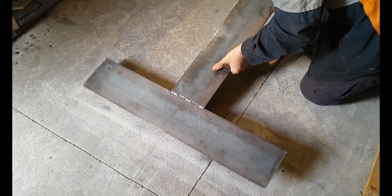You'll have a bottom plate that doesn't wobble. You need to measure the halfway point first. Get a scribe, scribe in your 10 millimeter mark for your halfway point, then measure down 35 millimeters — mark it, punch it — then measure down 95 millimeters from there, mark it, punch it. Use an 8 millimeter drill bit. That sets you up for your merbau bracket which will be bolted on.